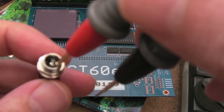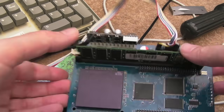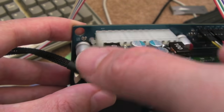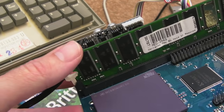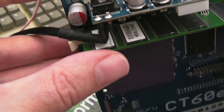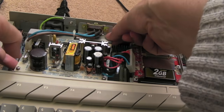The center pin is the main 12-volt supply to this little mini ATX power supply module. Normally you'd just stick an ATX power connector on here, but instead we've got this little DC-to-DC module — you can see a lot of components on the underside — to provide all the voltages that an ATX power supply would provide. So the next thing is to pull the power supply out with the connector off.